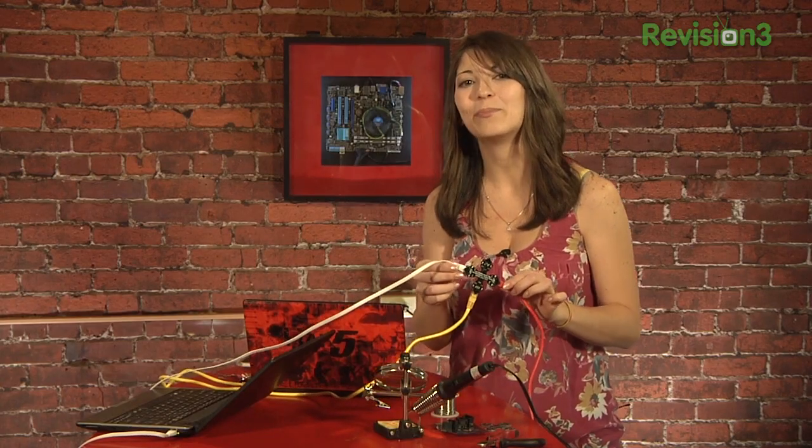A while back, our friend Mike Osmond built a 5-in-1 network admin cable that could do all sorts of stuff like serial console, crossover, and part of that was a passive network tap in a sort of throwing star design. Since then, the Throwing Star LAN Tap has been born under the Great Scott Gadgets brand. This little guy is a small, simple device to monitor Ethernet communications. To the target network, the Throwing Star LAN Tap looks just like a section of cable, but the wires in the cable extend to the monitoring ports in addition to connecting to the target. The throwing star comes as a kit, so you'll need to solder it together yourself, which is half the fun.